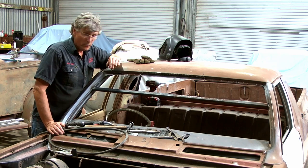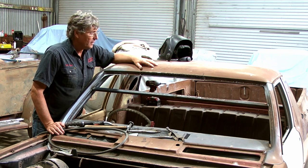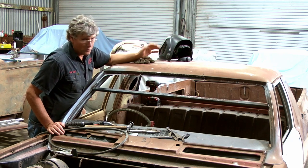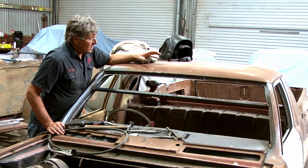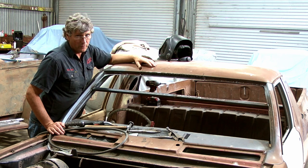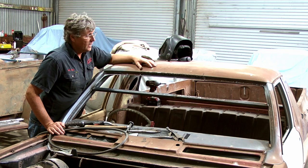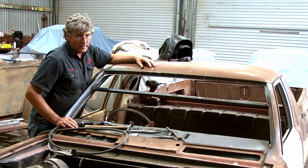Now, I'll throw this in while we're actually here. You'll notice with a lot of my stuff that I leave them as they were. Like, this hasn't been blasted or primed or anything, it's just been left with the paint that was on the car. And I've seen so many projects in my career where somebody started them, put them away for a few years. They've been blasted and primed at the start, or paint stripped and primed at the start, and that's just gone rusty while it's been sitting in mothballs the whole time, and you've got to go and repeat that process over again. So I tend to leave them as ugly as I can for as long as I can,